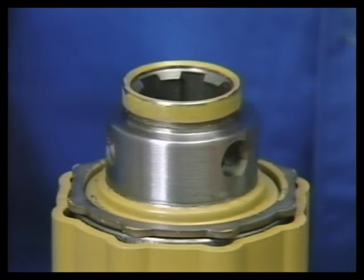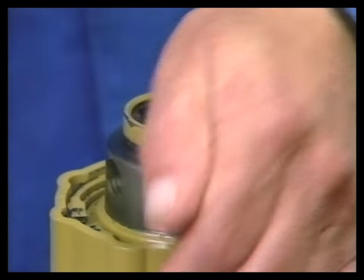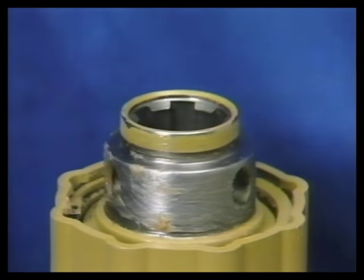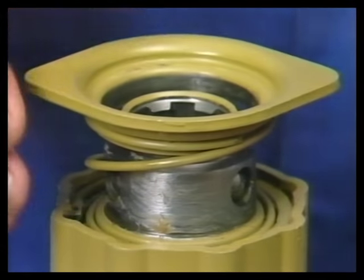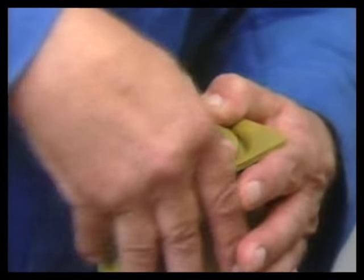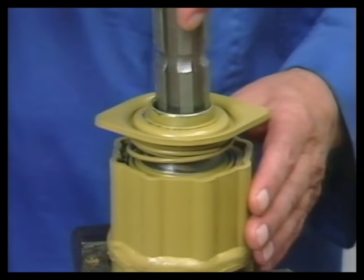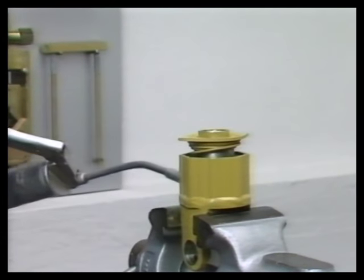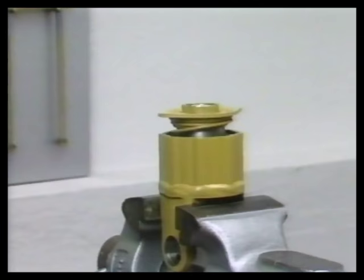Assemble support ring and circlip. Press hub into casing and locate circlip. Finally, the pull lock is assembled. After the retaining ring has engaged, the pull lock and then the free lock coupling are checked for correct functioning. After the coupling has been lubricated, it is ready for use.